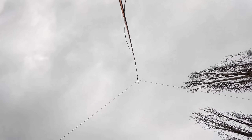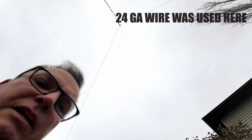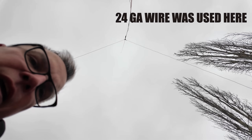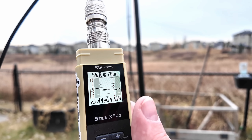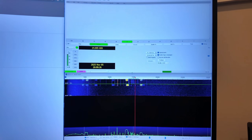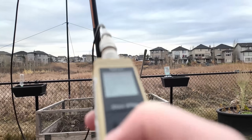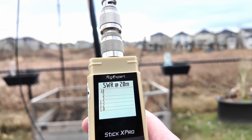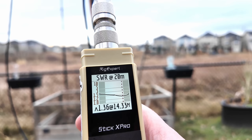How does RSE line perform? I'm going to do a quick Whisper test with two cycles — copper wire first, then the RSE line. You can see just the wire dipole above my head, and that's for 20 meters. We'll do the scan — 1.44 in the shack. Now we've got Whisper set up, bringing it in on my 991A. I'm going to run two cycles of Whisper on the wire. Now we've got the RSE line up. Let's do a scan of 20 meters — it's pretty similar, maybe on the upper end of the band, at 1.36.